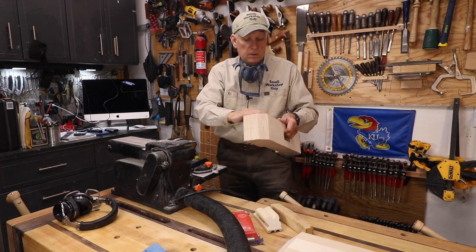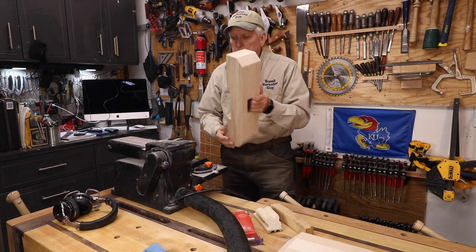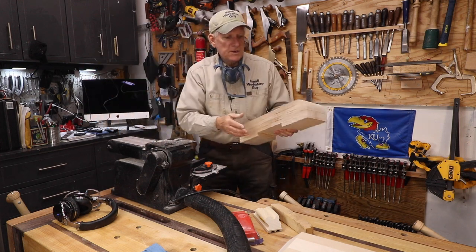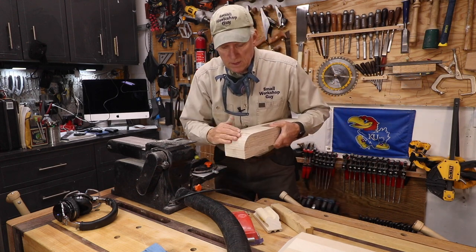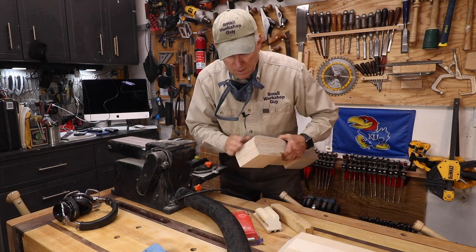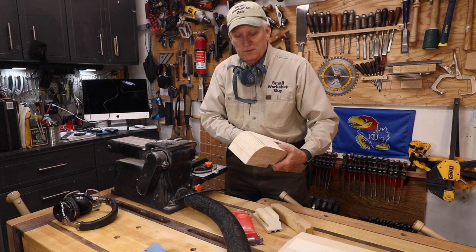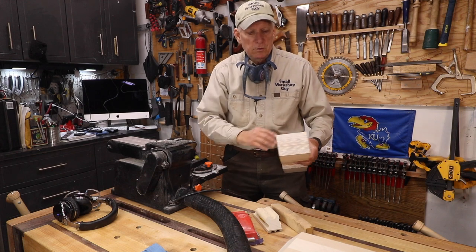And we're just now trying to clean up our feet and get these rounded over uniformly, and you can do that by holding it on here and rotating it against that belt. No magic. And it's going to look really cool when you get done, because all those layers of that Russian birch or that Baltic birch, when you polyurethane that over and you've got it nice and sanded, that actually ends up looking really, really attractive. So here we are with a plywood piece, but we're going to have some nice look to it.